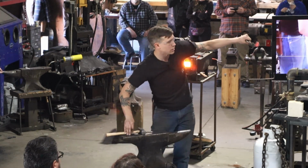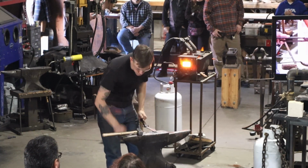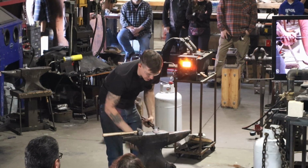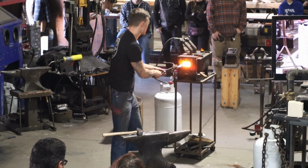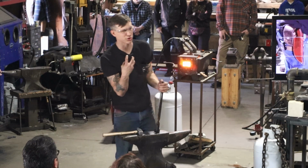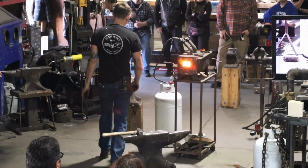So I got my heel a lot more like I want. It looks more like a knife now. My tip I probably got a little toasty. When we get over to the grinder, we'll have to see what's left of that. But I have noticed when you're going to be forging a lot, in and out of the forge a lot, you can leave the tip squared off or real chunky. And then the last thing you do could be to put that tip in. That's especially true with forge welding temperature and stuff.